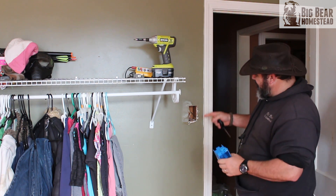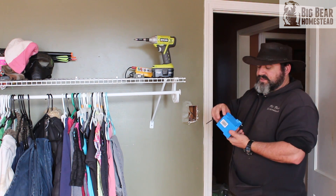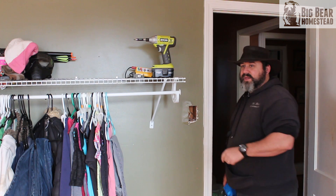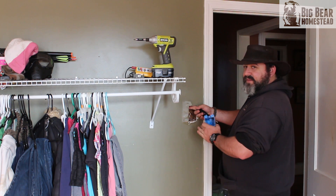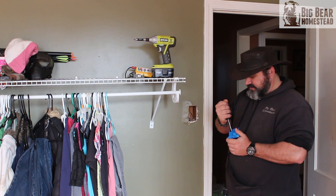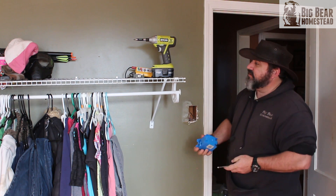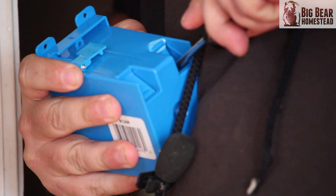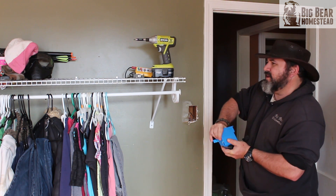Pick a side — make one side up or down. If your wire is coming up from the floor, pop one of the knockout holes on the bottom. Ours is coming from the top, so we're going to pop one from the top. Our wire is also hugging the left side of the wall, so we'll pop the left-side hole. Just take your screwdriver, pop it, and push it in — give it enough room for the wire to go through.